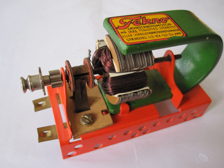Later designs, from around 1900, became more compact with shorter, more efficient magnetic circuits. The field coils now moved into short, squat internal coils around the pole pieces themselves. The remainder of the magnetic circuit was a double-sided circular path around the casing of the motor. This circular layout also represented the end of the bipolar motor as an industrial power source, as it was possible to place a second set of field coils and pole pieces within the same size of casing, giving a four-pole arrangement.